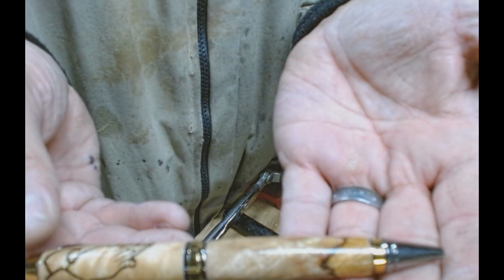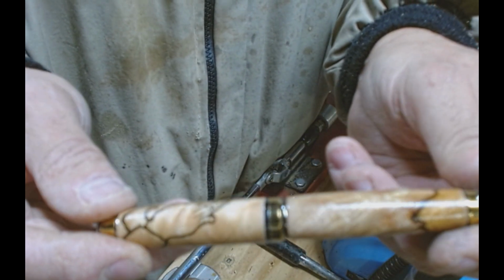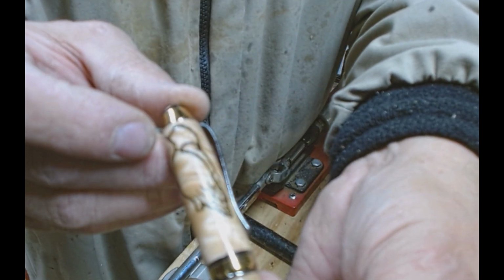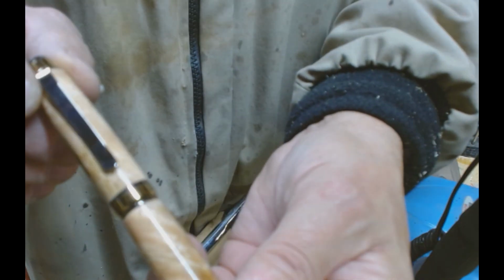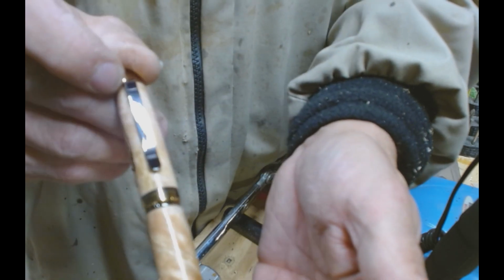Thank you for watching. Today we took a mango wood blank. We then cut it to the size that we needed for the pen. We drilled it, we cut it, we laminated copper bushings in there. We turned it on a lathe, we sanded it, we engraved it, and we put an acrylic finish on it. I hope you enjoy it. We created a beautiful pen that's a keepsake.